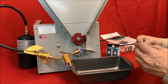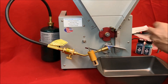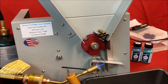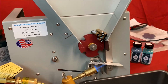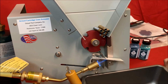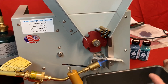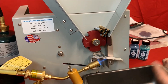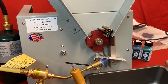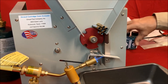You don't have to use your brand new sorted Lapua cases for this part of the setup — any case of the same size will do. Once you have several cases, put a few of them in the hopper. What you're looking for is this green color will disappear and turn clear; the gray color will also change. You want to see the green color inside the case neck turn clear, then count no more than one additional second before the case drops out of the machine. That tells you the case neck has reached the proper temperature. Once it comes out, examine the gray stripe on the outside and make sure it goes no lower than halfway down the case body, confirming the case head and primer pocket are unaffected by the annealing temperature.